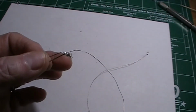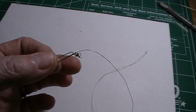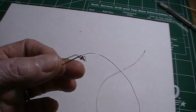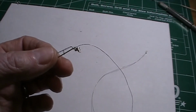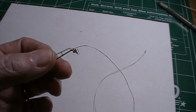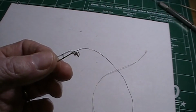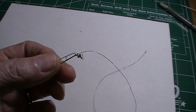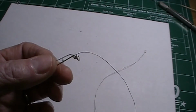So we can go ahead and push that on down through, get it mounted on your layout, the wires underneath the workbench. Then we can nip off about 1 more inch of wire and separate the wiring. Hook the red tinted wire up to positive, and by grounding out one of the other ones, ensure that you have a resistor in there. But then you can go ahead and determine which is the red, the yellow, or green. This is really a good time saver.